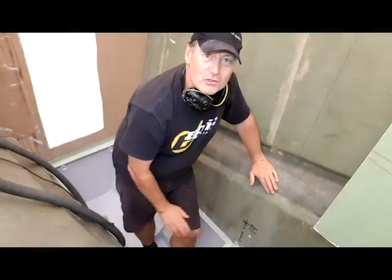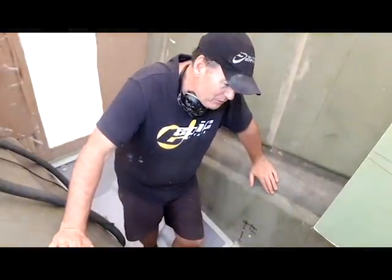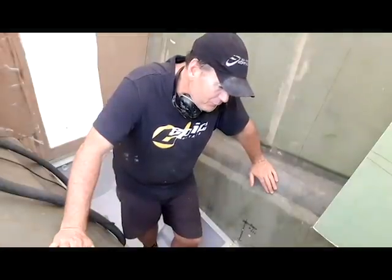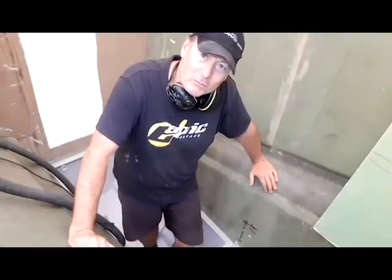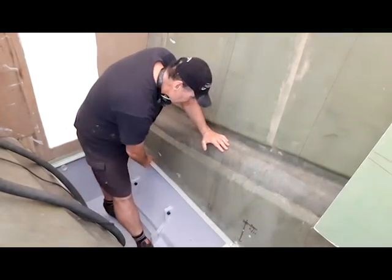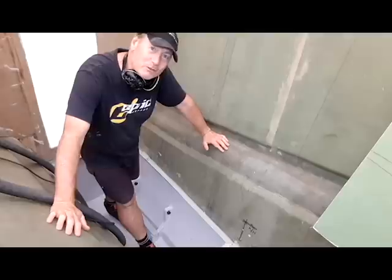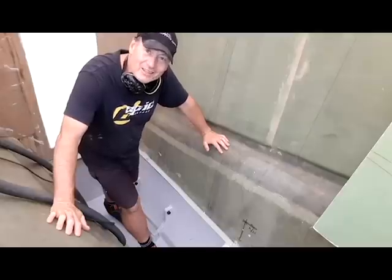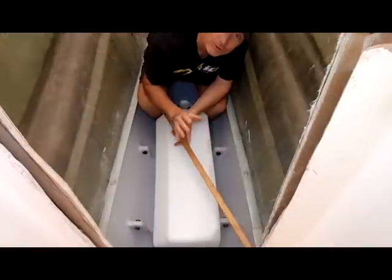I've deliberated daily on whether I'm ready to put this in. I've now added extra conduits through the bulkheads and the water tank is sitting in the section behind me. It's important to think all that through because I try to think 12 months ahead — making sure I've got adequate passageways for water lines, deck washes, and all that stuff so I don't have to be drilling holes and sealing epoxy up under the floor hatch later.